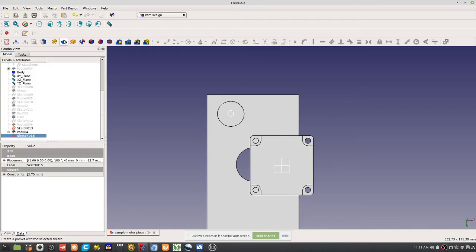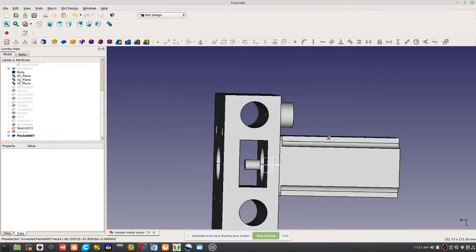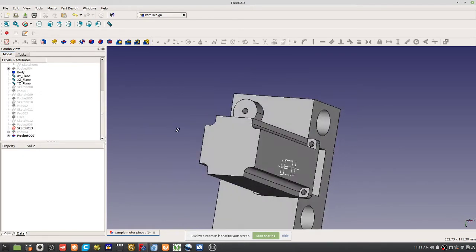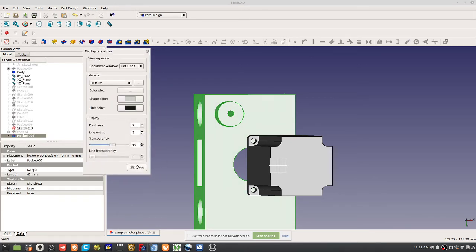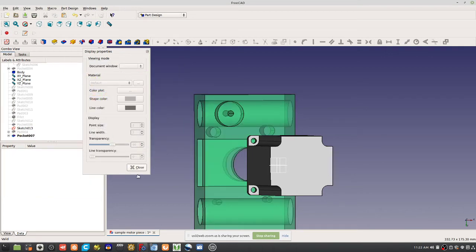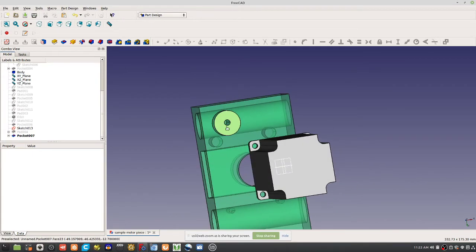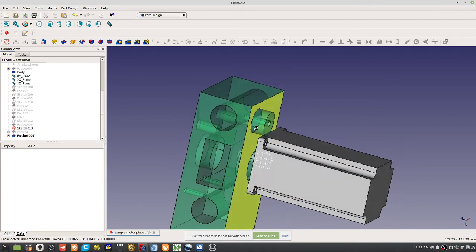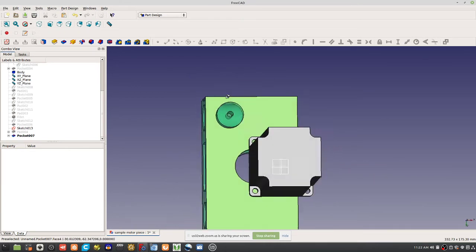The claim here is that if we pocket that through, see, we pocketed that through. Appearance, make it transparent. See, this transparency thing happens on my other screen. So you've got that set screw there. You can put an M6 screw in there and then hold the rod. You see that? So we can do a feature like that, at least one on each side.